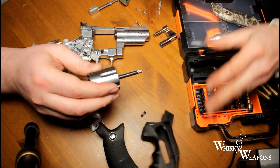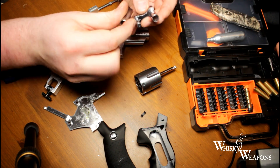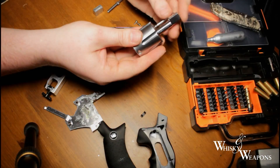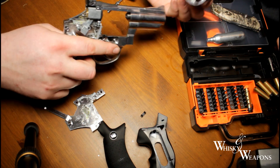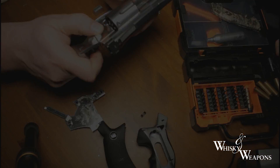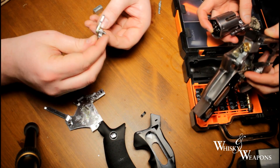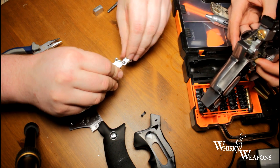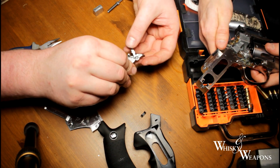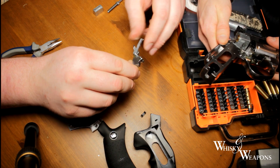The old one - throw it away. Just make sure these look the same - yes, that looks identical. There we go, that's the one. It slides through like that. Don't lose anything when you're tipping it over. It looks like there's a pin on the other side too - there's a little retaining spring. Remember which way that comes: pull that down and it drops in. The new one goes in the same way - pull that up. That's the indexing post changed!